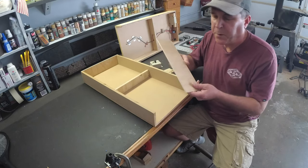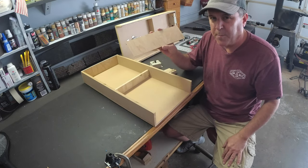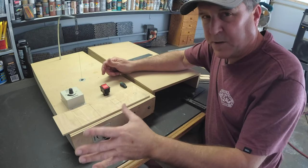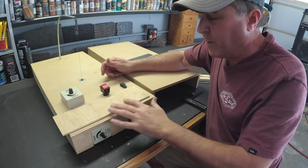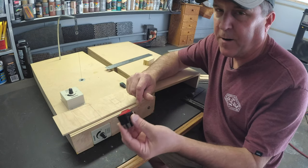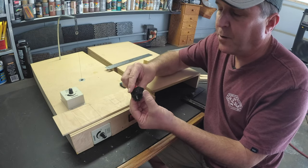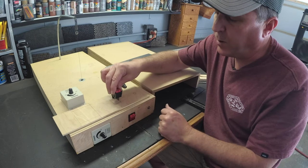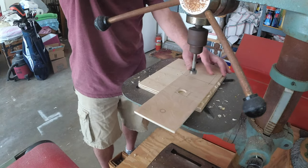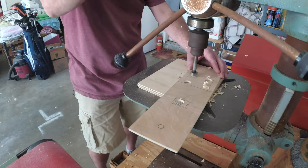Let's move to the front plate. I'm going to install all the electronics on this piece and then we'll move to the next step. I've got all these measured out where I want to put them. There's no exact measurement here, so just kind of place them about where you want them and try to get it as centered as you can. Remember with these switches there's an inside edge and an outside edge, so you actually have to cut it a little bit smaller so it will snap in place. I'm going to use a bandsaw to cut the holes out, but it's easier if I drill out the corners before I start cutting.